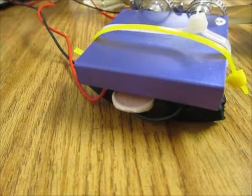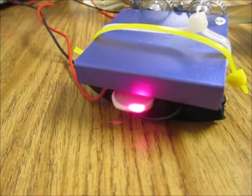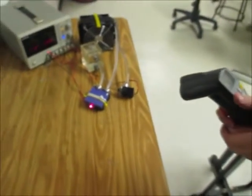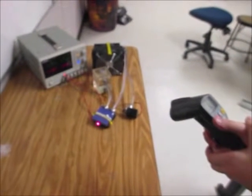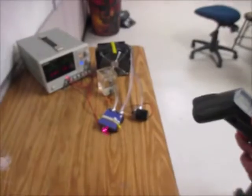Look at the frost on the penny. That penny is attached to the cold side of the Peltier, which we have clocked in at about -8 degrees Fahrenheit. The all-time low I calculated for the cold side of the Peltier was -14 degrees, the average being -10 degrees.